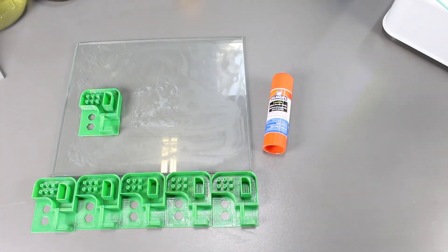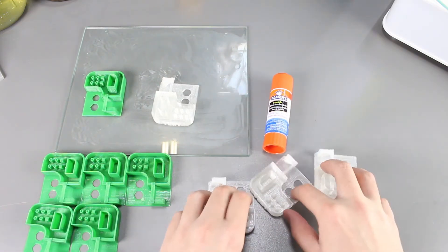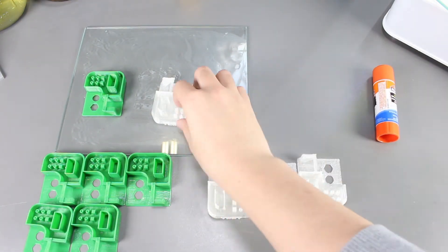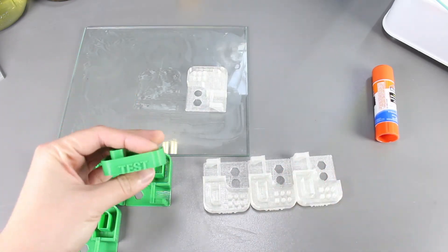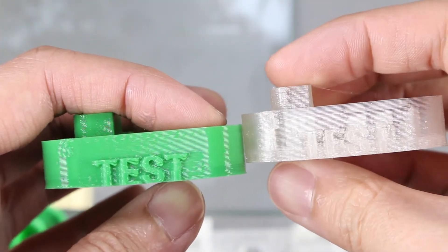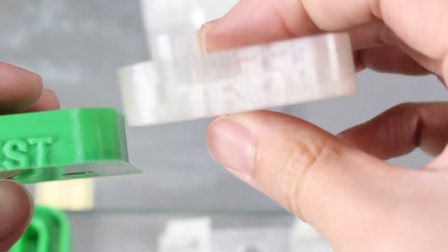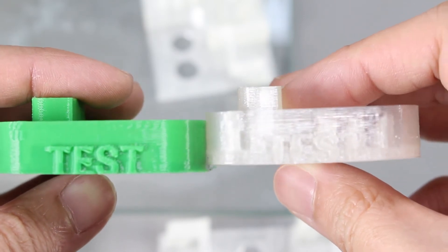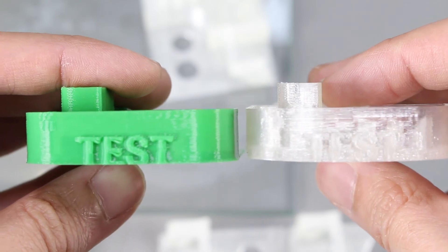I was actually printing on the side with just glue stick on another printer so that we can compare. I printed 4 times on that printer and it looks like it can still keep going. Let's take a closer look at the 2 prints. They both curled up in the same place, but we can see more of a curl on the glue stick side — just very minor curling. Now looking at the 6th print and the 4th print, which is the last print for both bed adhesives, the glue stick water solution still had minimum curling, but the pure glue stick one curled even more than before.